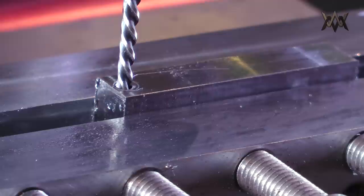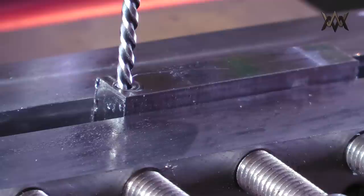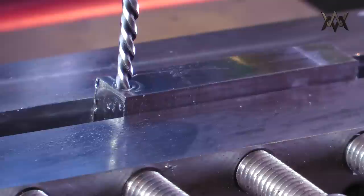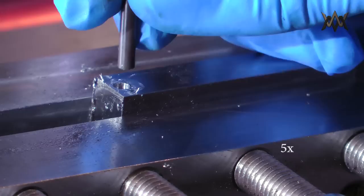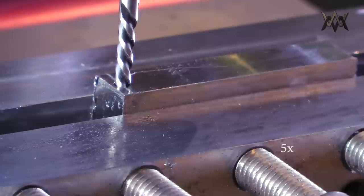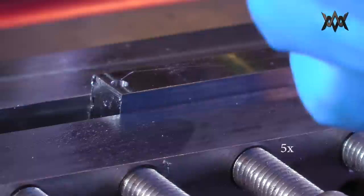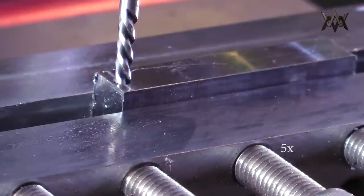Now the traditional way you do this is hand ream it with a 2-0 taper pin reamer, as you see me doing here. That takes a long time to get down to the proper depth. So what I wanted to do was write a program to do this via CNC. Unfortunately, what I found is these taper pins, while they're very close in size, they're not uniform. You might get a larger one, you might get a smaller one by just a little bit. So the pins really need to be hand fitted in there. But since it takes such a long time to do this reaming, because there's so far you have to go, I wanted to CNC most of it. So it comes down to a certain depth, but not deep enough to seat the pin, and then do the rest by hand.